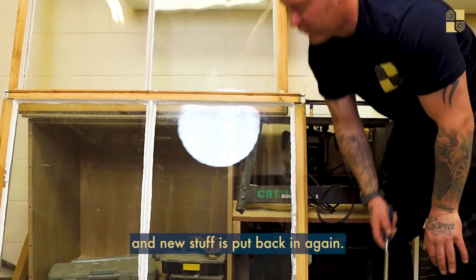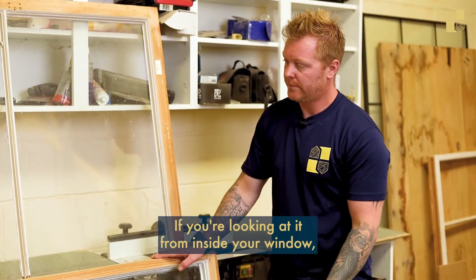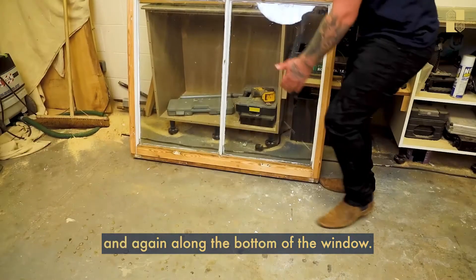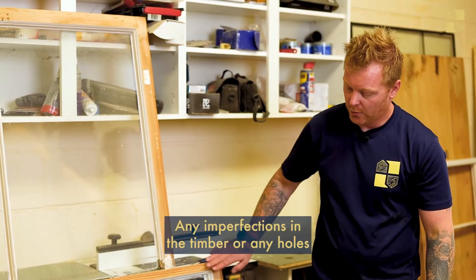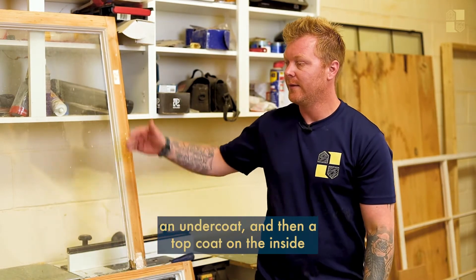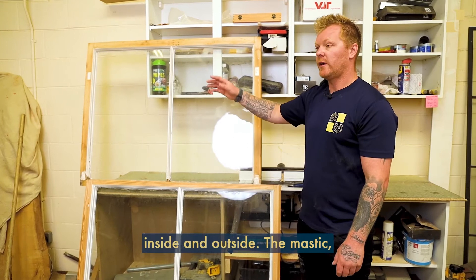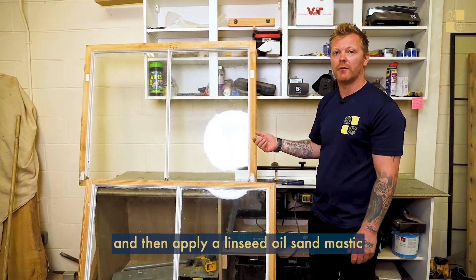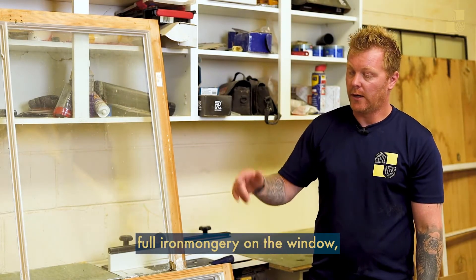We tidy the paint line all the way up and down. We don't strip out all the putty — any loose putty is taken away and new stuff is put back in. This is the renovation of the window. We then draft-proof the window, which consists of parting beads fitted up the sides, a router draft-proofing strip along the middle, along the bottom of the window, the mid-rail, and the bottom rail. Any imperfections or holes in the timber are filled with two-part filler and sanded. We then apply a primer coat, an undercoat, and a top coat on the inside and outside. The case holding the window has paint burnt off inside and out, the mastic is scraped out and reformed, and a linseed oil sand mastic is applied. New ropes, parting beads, and batten rods are fitted.